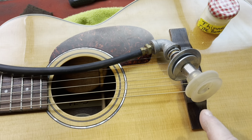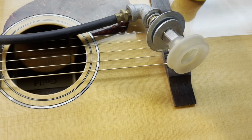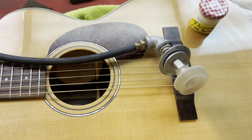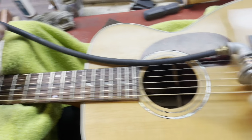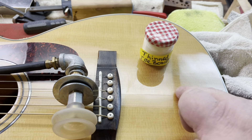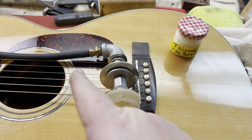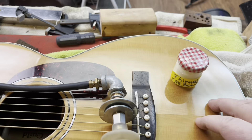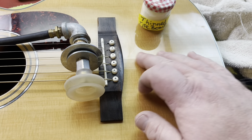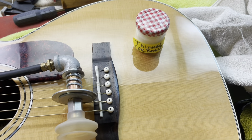What I've got here is this rig that I made up. This is actually a suction cup from my guitar vice — from Total Vice — but I don't use the suction cup for it, so I use it for this. It's got a hose connected to it. I've got some thin Titebond and I'm going to put thinned Titebond all along here, then blow into the tube to push it down into the joint. Since it's been in a moisturized environment it's actually kind of closed up, so this will push that glue down inside and I'll just clean up the excess.